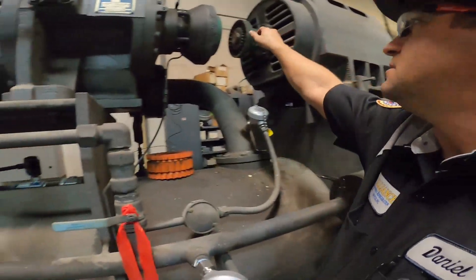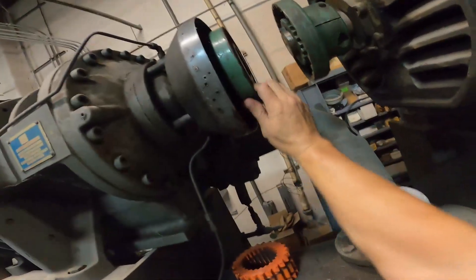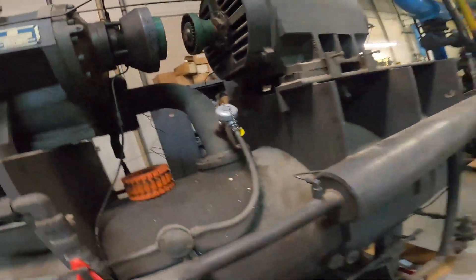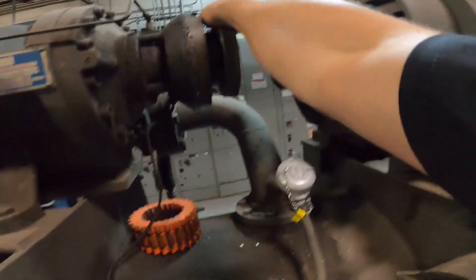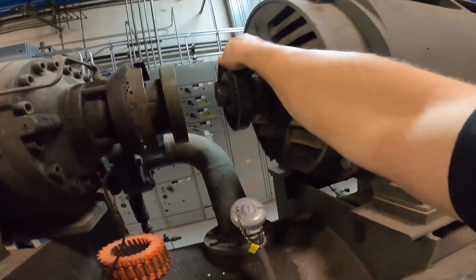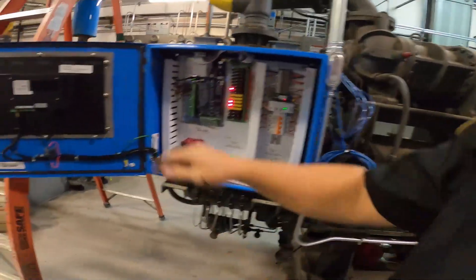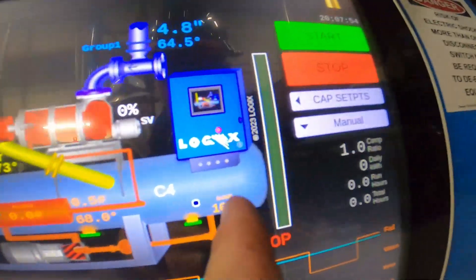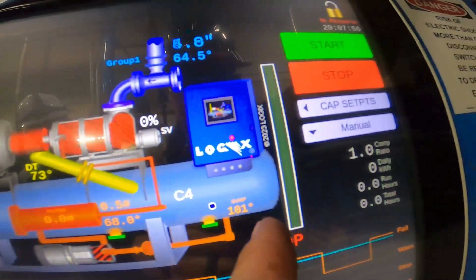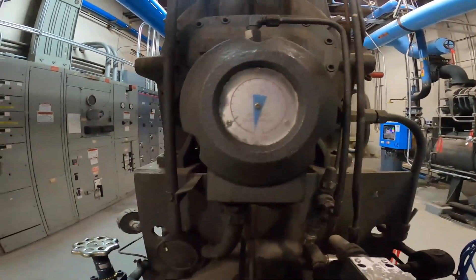This one sounded real good as well. So things are good here. Let's see it rotates there — that oil did help out. Everything's good, everything rotates. All the sensors are working. You look at the screen here, you got all your sensors. You have your sub temperature at 101 degrees — that's set to 115. There's slide valve at zero, and if you look at the end here, it's at zero there.